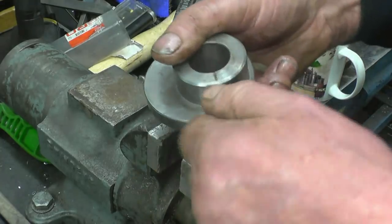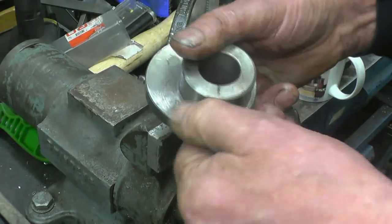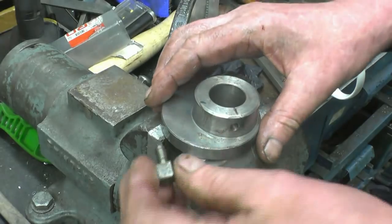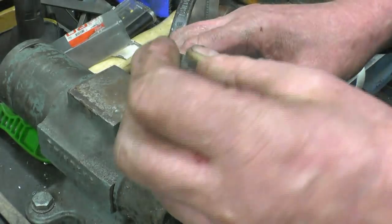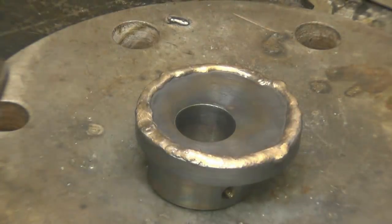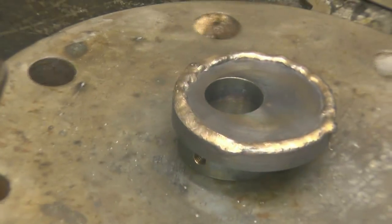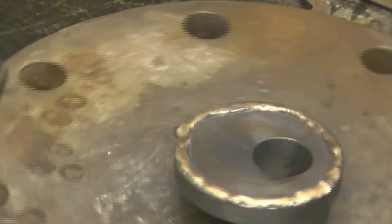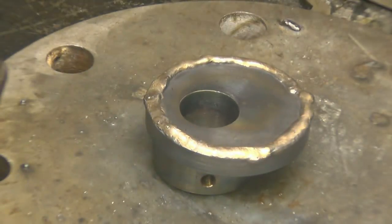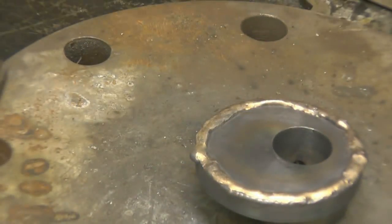When I made the screw I did put a little bronze tip in the end so it doesn't want to crank when you tighten it on. Then I put a bead of silicon bronze on the outside of it and it went on quite nicely. This would be an ideal job for the rotating table I built for the welder, but I forgot to bring it. Anyway, it's welded up now — we'll let it cool off and then go on to machining it.